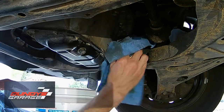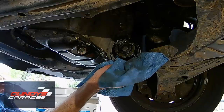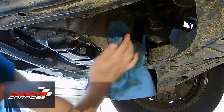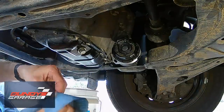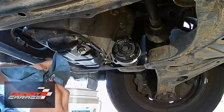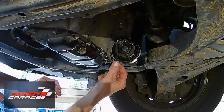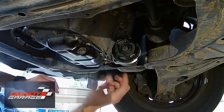This is probably one of the easiest oil changes I've ever done. I love the fact that the oil filter drips right onto nothing — nice and easy. In some Hondas the oil filter sits right above the lower control arm, part of the suspension. Here we're putting that little retaining clip back in to prevent the filter from backing out when you're driving down the freeway, getting it nice and clean and popping it back in. It snapped in there, no problem.